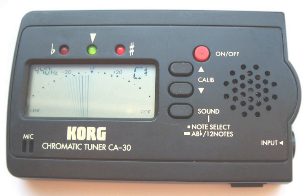The first automated guitar tuner was invented by J.D. Richard in 1982 while studying electrical engineering at the University of New Brunswick, Canada. This tuner was based on a phase-locked loop feedback design that listened to the frequency of the string and turned a stepper motor with a 400-to-1 gear ratio attached to the tuning peg of the guitar. This first design never went into production.